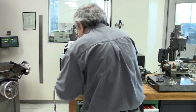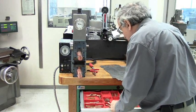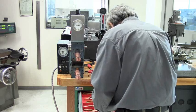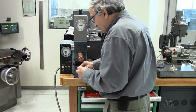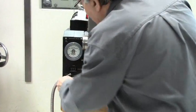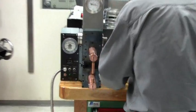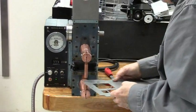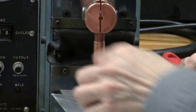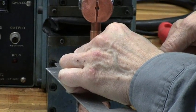The trick in fixing it: you always put an oversized piece — slightly oversized — above the defect, and then you just melt it into the hole with the spot welder. In this case, since there is an extra slot there, I just cut a strip which is a little bit wider than the slot, maybe by half a millimeter or a millimeter. Set it to a fairly high setting — because it's a big area I'm going to melt over a big area — so set it like number eight. This is the extra little piece I cut out. I lay it above the defect.